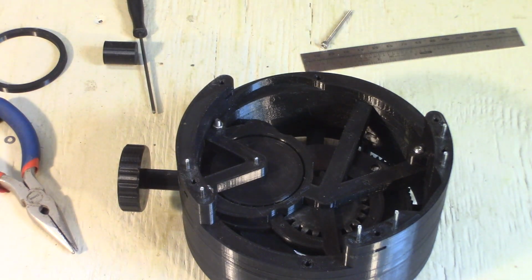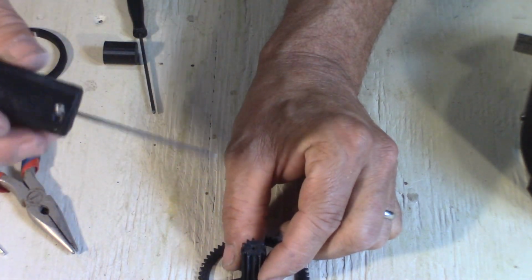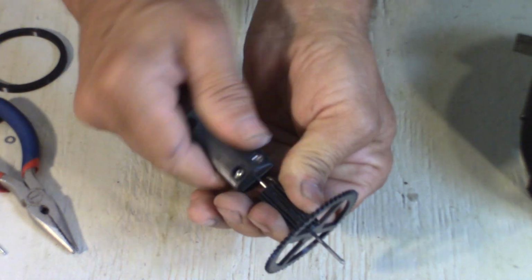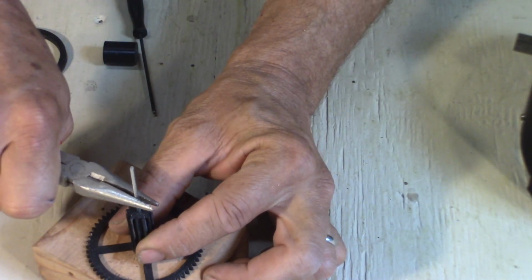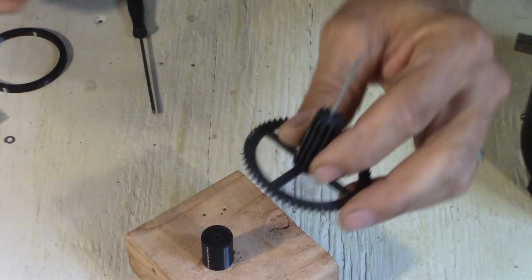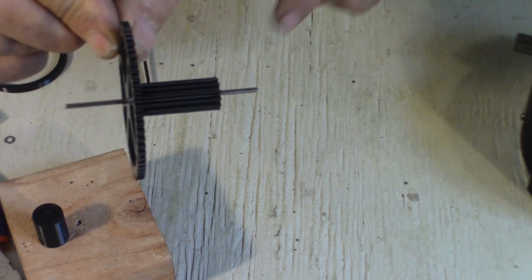Okay, other side. Put the arbor in the gears. So it helps to just prep the hole sometimes. It's still tight enough, and if it's too hard, some pliers. Then I can use this tool, push some more. So I adjusted the position, check the instruction to see the measurement here.